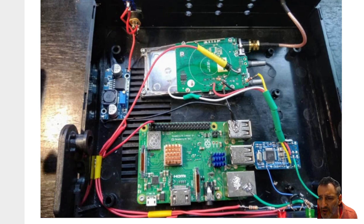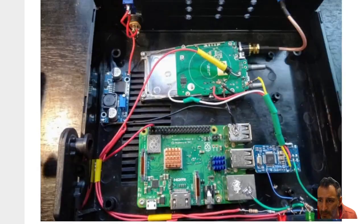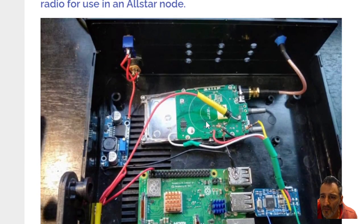That looks like the audio going to where it says mic. You've got a resistor there as well going to mic. You've got a red wire here. The white is the COS and the black as well. Follow the instructions step by step and you'll make yourself a node. On the left here, you've got the buck converter, which is powering everything — powering the radio, powering the Raspberry Pi. You can see that the voltage is dropped down on each device to make sure there's not more than the required amount of volts going to the radio, which is about four volts. And on the Raspberry Pi, it's five. I would set it up at five, then put a resistor in to get it down to three or four going to the radio.